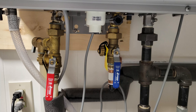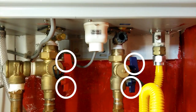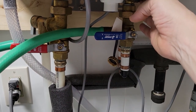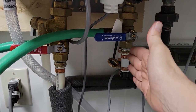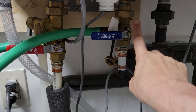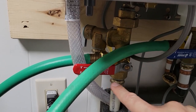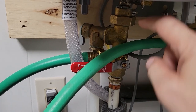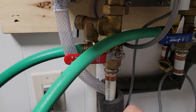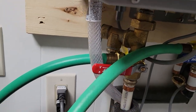What's different on this unit is the service valves or isolation valves are only one per inlet and outlet, instead of the two that we saw in the prior system. Water normally comes up and goes into the unit — this valve would be in the down position. When you turn it 90 degrees, water is coming in from the outside going into the unit. Over on the hot water output side, normally this red valve would be going down and the water would just go through into the house system, but when we turn it 90 degrees the water is now going out this tube down into our bucket.